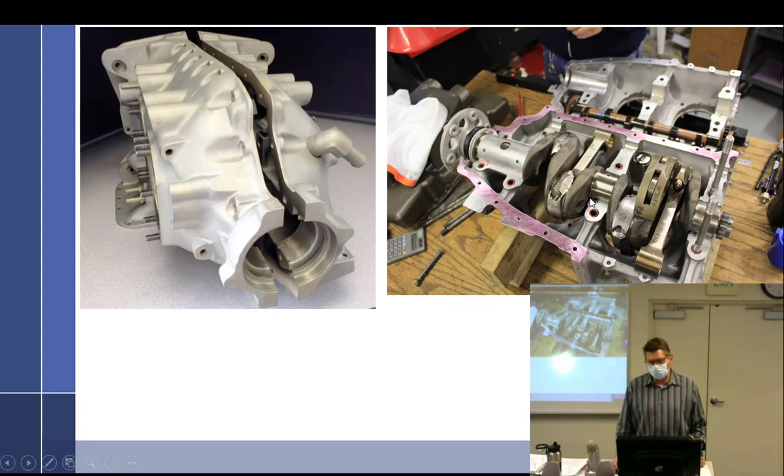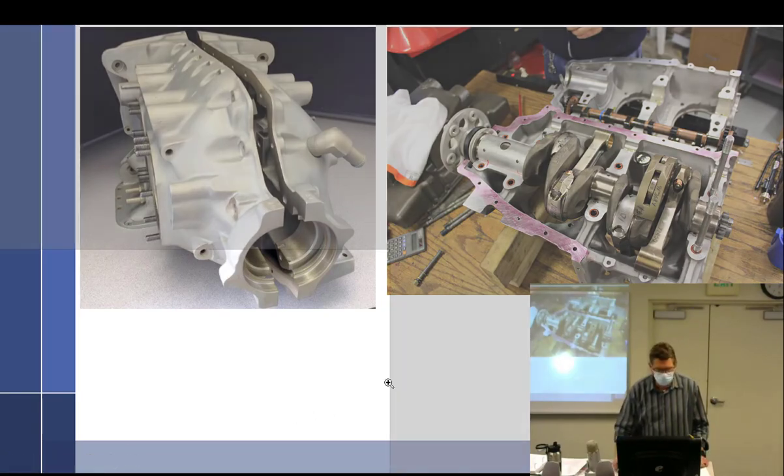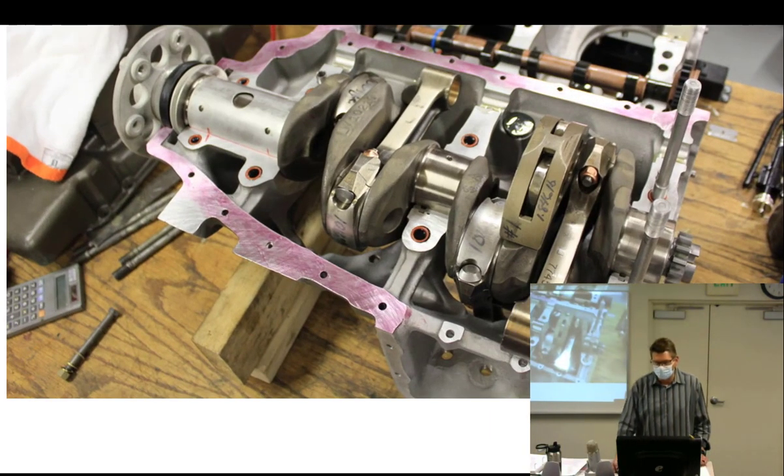The other thing is, I'm looking at this picture. Can you see the little O-rings down there? Now, O-rings, you need to be careful. When you slide an O-ring over a stud like that, when you slide over the thread, you damage it. And how do you change out a damaged O-ring in this location? You don't. You take apart the whole engine. That's very expensive. So you don't want that.